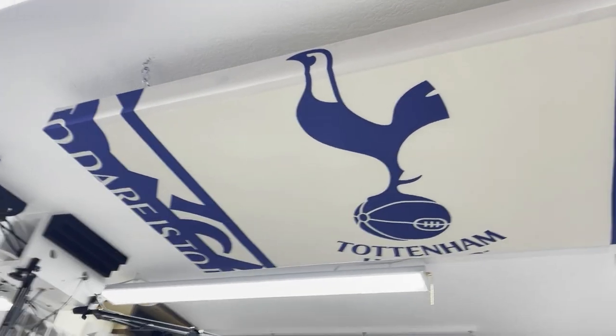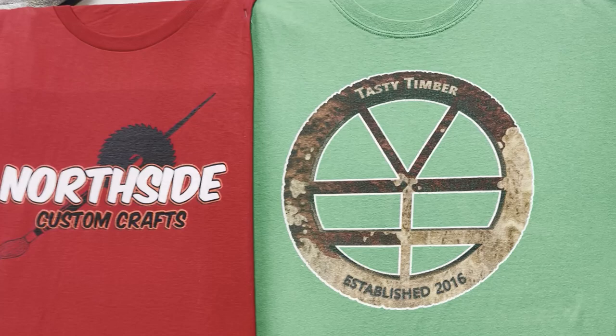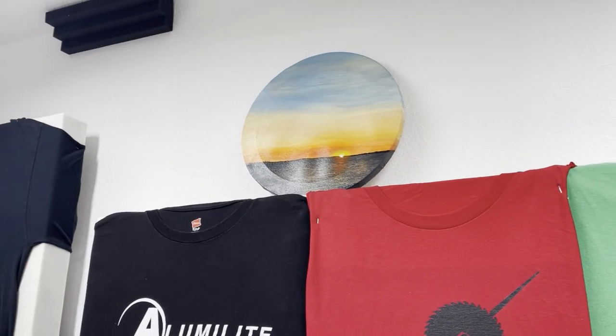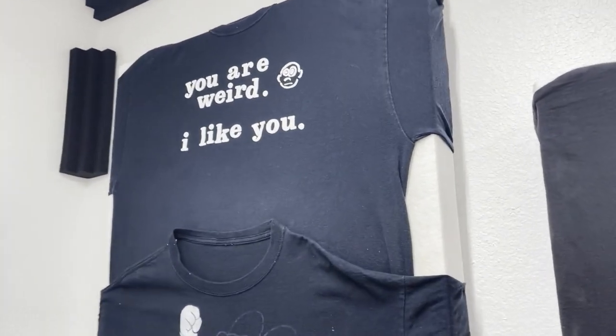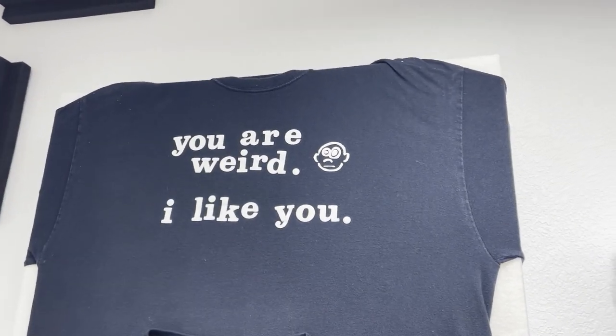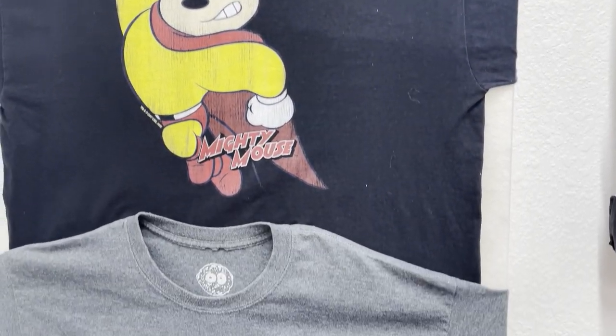These things are floating off the walls. I've had comments after one of my last videos talking about how if you have it off the wall, then that helps out a lot more. So I did the French cleat and I just left the 2x4 there at a 45 degree angle, and it comes off the wall exactly right. And at the bottom I put a piece of 2x4 to space it off the wall the exact amount. So I think it turned out pretty well.